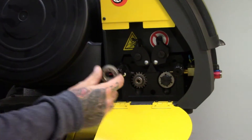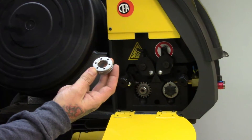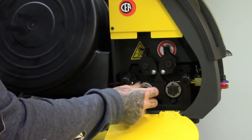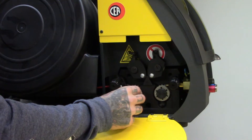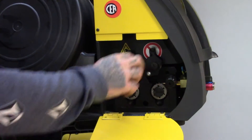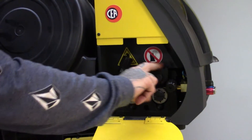Let's pull one out and see if I can figure it out. You can see there's a little finger here that mates to the gear — that's where it goes back into. This is a 1.0 and 1.2, pretty standard. The other side is going to be exactly the same. That's a very nice drive roll system. I'm impressed with that. I've done a bit of MIG with this before and I know it feeds smooth, and this is basically the reason why — this is the heart of all that.